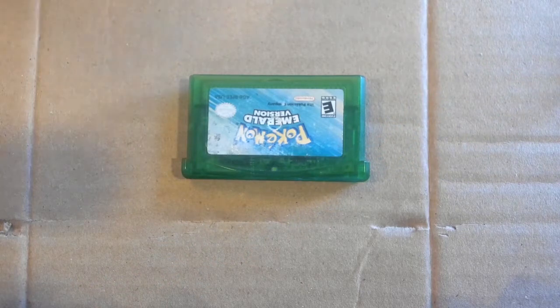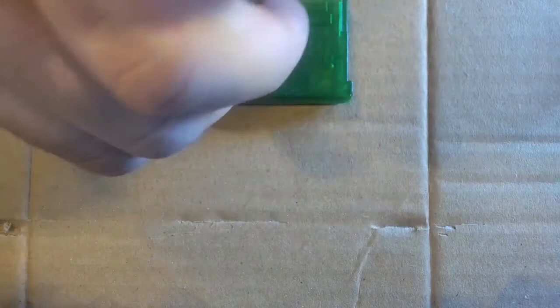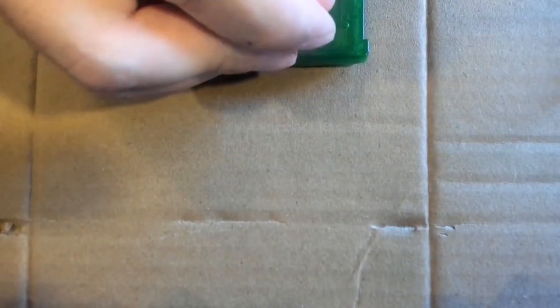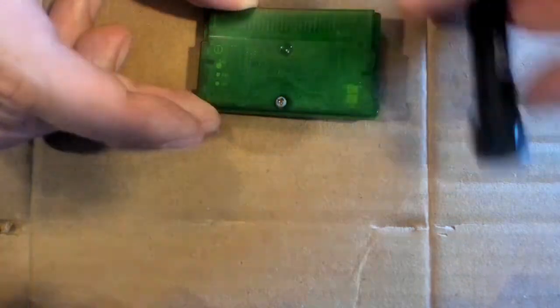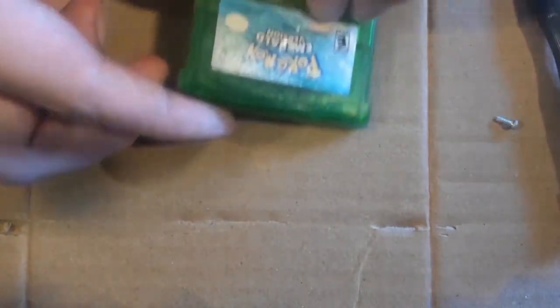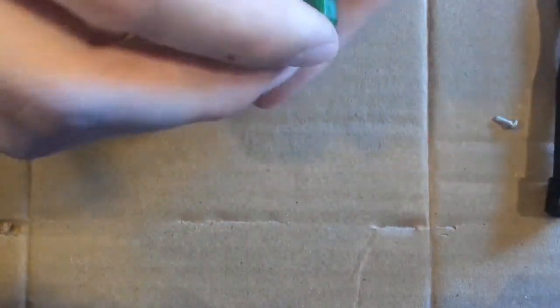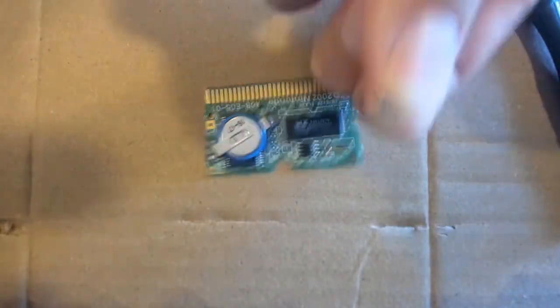The first tool you'll be using is the tri-wing screwdriver. These can be purchased on Amazon, and I will include the link to the one I use in the description below. So with this tri-wing screwdriver, you will need to unscrew the case from the back. Next thing you will need to do is slide the faceplate down and remove the board from the enclosure. Make sure to put the screw in a safe place so that you don't lose it. You'll need it later.